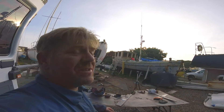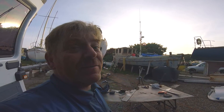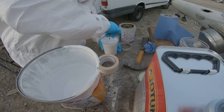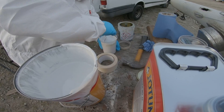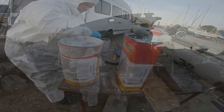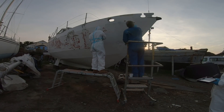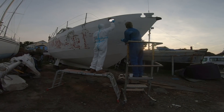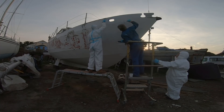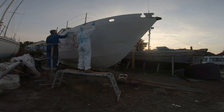The final bit of surface prep with the good old Turku rotary blaster. Melissa's just finalising the preparation of that surface ready for painting. This is just the primer, remember — we still haven't decided on the final colour for the topsides, but the primer is Jotun 87 2-Pack Epoxy Marine Primer, and even on its own it's super stable, so we've got plenty of time to decide what colour we want to put on top.